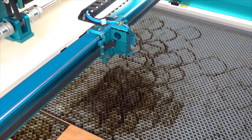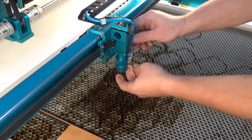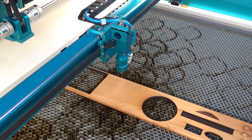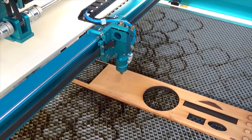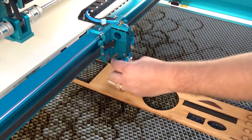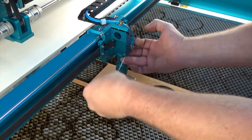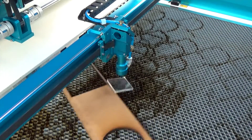So let me remove this. I'm going to put the stop on there and just let it be loose, then push this all the way back up. Push the air assist back in. Let's autofocus again. Okay, autofocus is back where it needs to be, but you'll notice you're way out of focus. The way to remedy that is to drop the tube down, tighten it back up, and then put the stop back up to the very top and tighten it back up. And now it's back to normal.